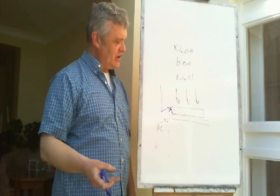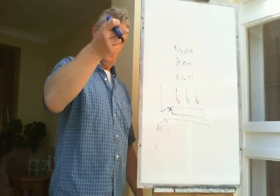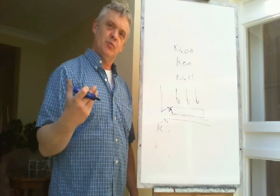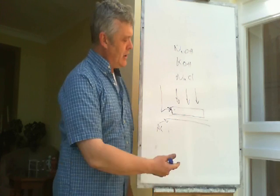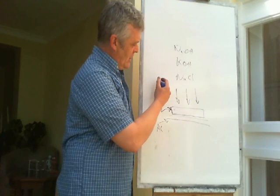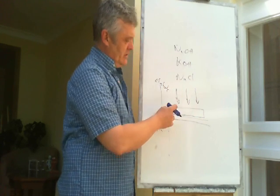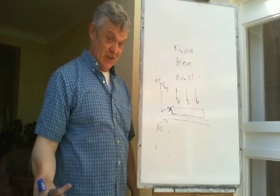What I've done is taken a pre-existing sponge with a high surface area already, and coated it with my conductive ink. So it really becomes a very simple process of taking the sponge, dipping it in the ink, letting it dry, and suddenly you have this electrode structure already made for you. The battery becomes really a piece of cake.